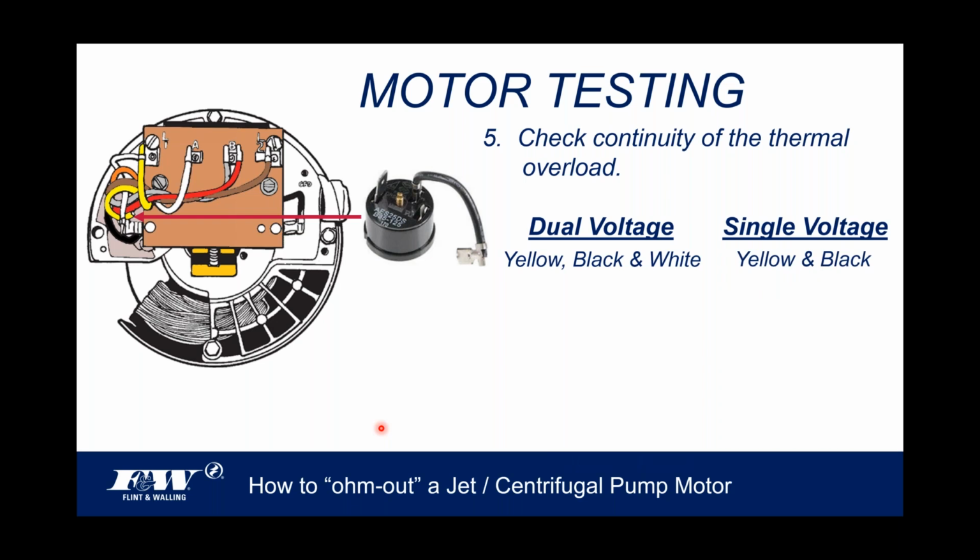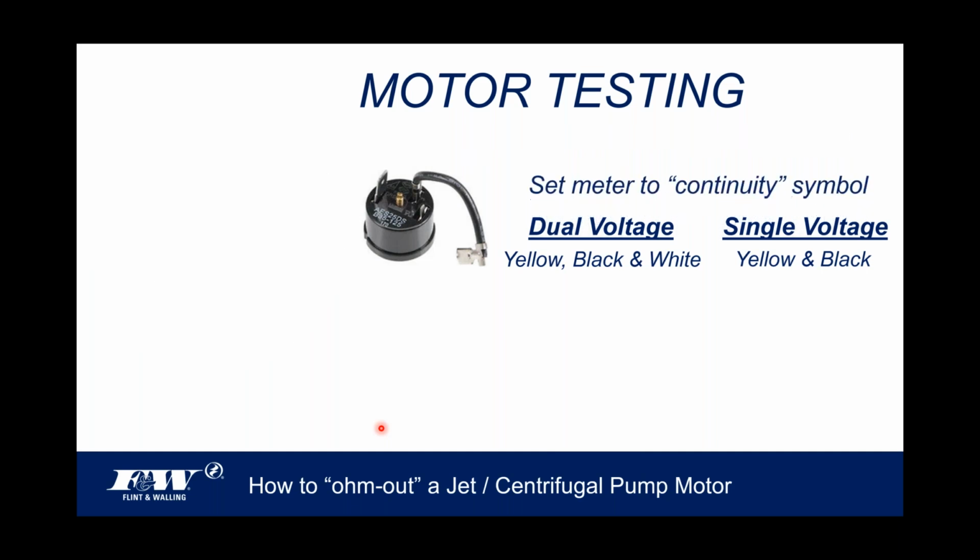If you happen to test a single voltage motor that doesn't have dual voltage capabilities, then there's only going to be two leads on that thermal overload, a yellow and a black, all right? And again, I've got these all in note form for you so that you don't have to necessarily write this stuff down as we go along. So here's how we test the continuity of an overload.